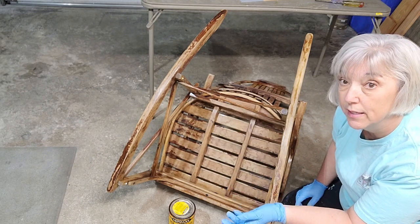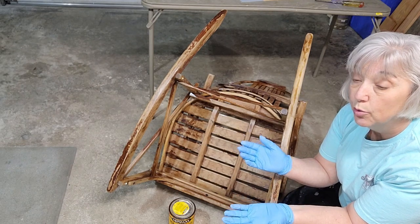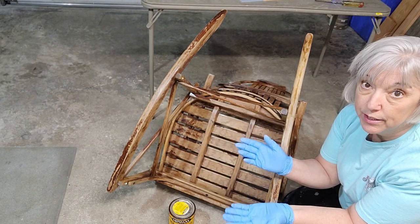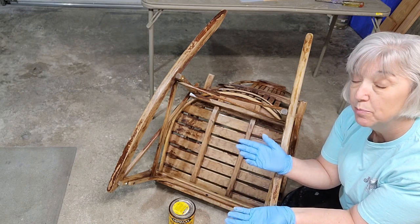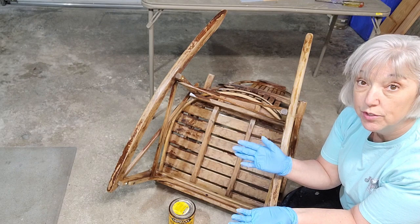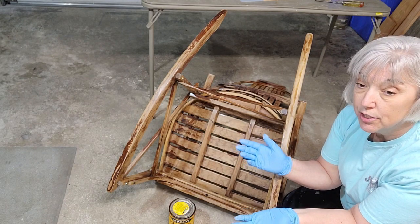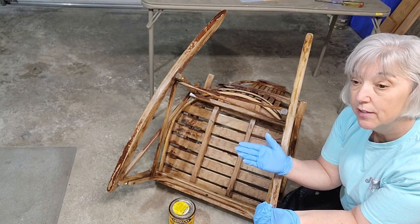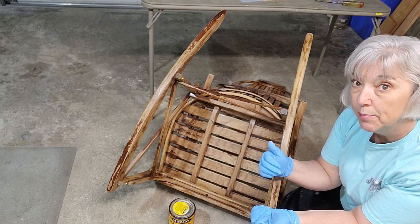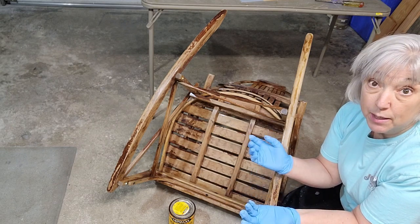It may never be, like, you could use two different kinds of wood and the same stain, and one wood will come out really dark and the other one won't hardly look like you did anything to it. So you just have to experiment and see what you can do. What I've done on the woods where it doesn't seep in very much is you might even consider a gel stain, because then it stains it, it lets you see the wood through it, but it sits more on top and doesn't seep into the wood, and that might be an option to consider.